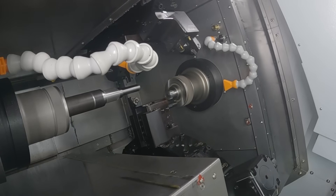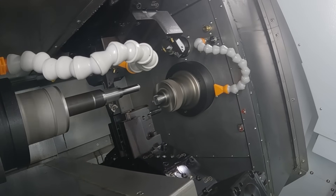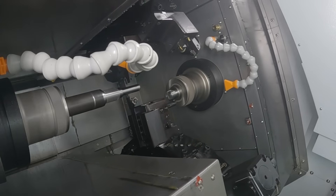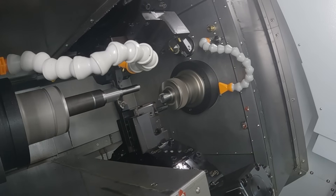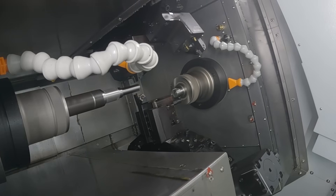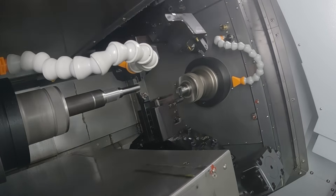You can kind of rethink the way you make the part — you're not going to concern yourself about making sure there's enough space. I like the way you've got a tailstock above it as well, so that can be used to support a longer part coming out of the main spindle. In this position you have the three-turret machine — three tools working — but it's not normal at this machine. About the bar, you can take a really long bar and have no problem with the main spindle and the sub spindle being in collision. And with Y-axis on top and bottom, you can make a drilling outside of the centre, you can make a turning in the right position. If you have a really special material that gives problems, you can go a little bit in the height — the turning is better, the surface would be better. This you can do with this machine.